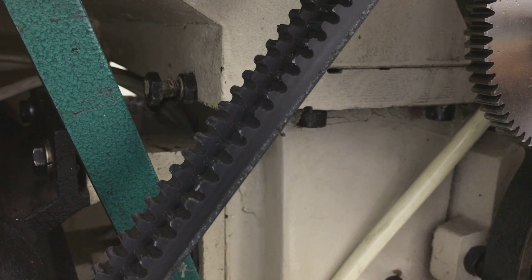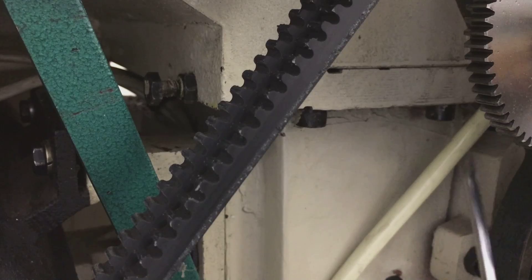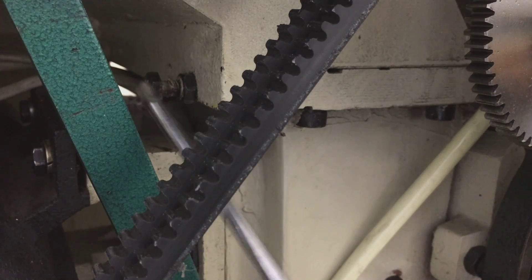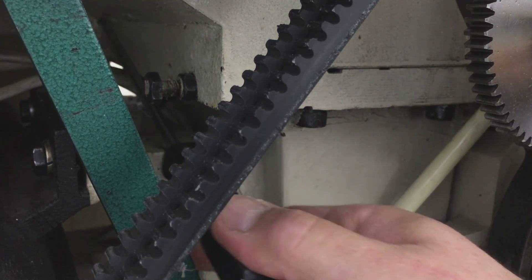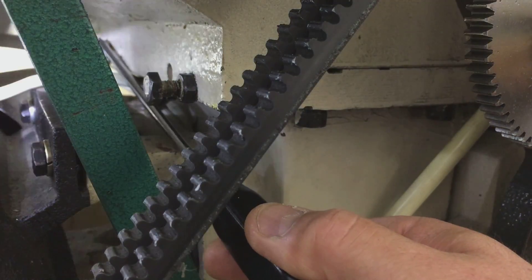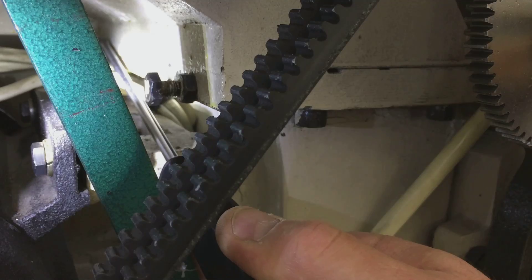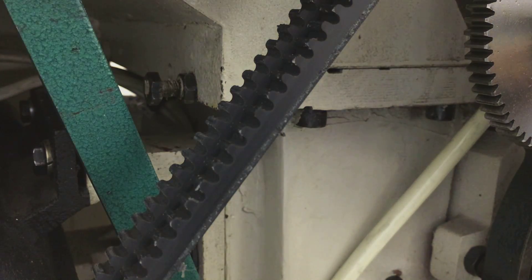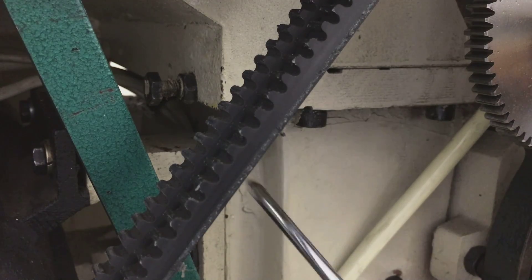This is the gear-side cover that we just took off. The head is attached by four screws — two in the back, and I'll take you around the front to show you those. These cinch the head down to the gearbox, and then here you have an adjustment screw that pushes up against the gear case, and there's one back in here too. There's an adjustment screw with a shoulder nut back there, and one right here. That's how you move the head either in or out — away from the cutting tool or into it. So basically we're gonna loosen the four bolts holding the head to the gearbox, leave them a little snug, and then work with the adjustment screws.